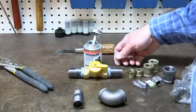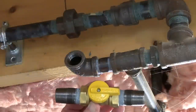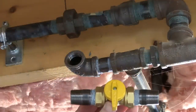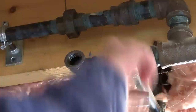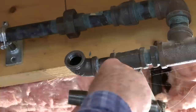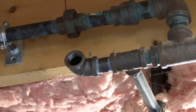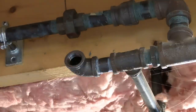You can have a complete shutdown of a major appliance if Teflon tape gets into an orifice — it's a very difficult thing to find. I want this shutoff to close by pulling it down. In other words, when I reach up in an emergency, I want to just be able to reach up and pull down — it's a lot easier to grab and pull down even with a hook of some sort. So I've got this nipple ready to go; I'm just going to apply some pipe dope and thread it right in.